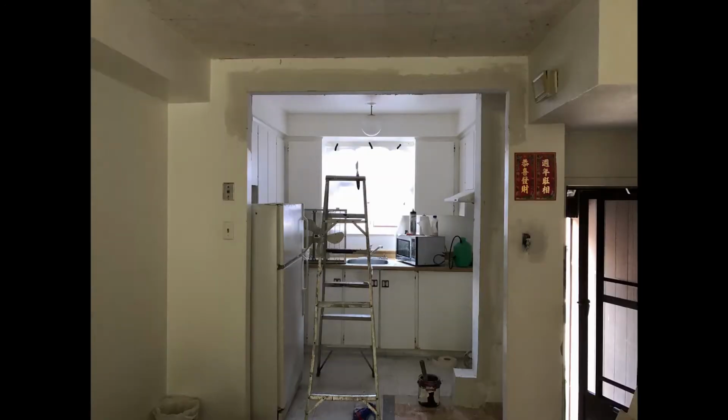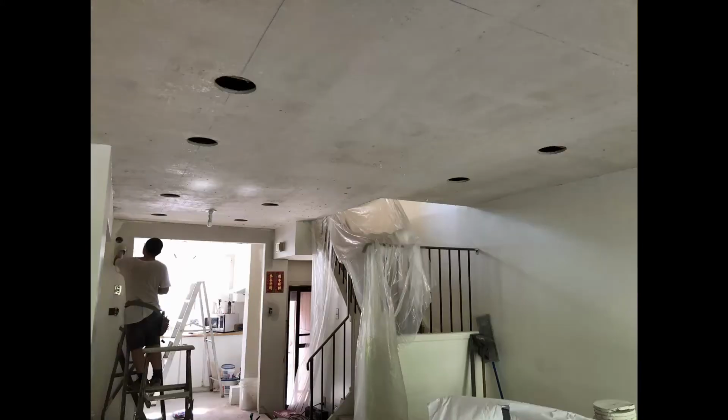Moving on to day 4, I finally started to bring my GoPro to get some time lapses. We also made some holes for recessed lighting. Modern designers will say to use 4-inch lights to make your space look bigger, or even these lights called gimbal trim, which allow you to move the positioning of the lights. But we opted for 6-inch lights just to ensure that we had the space lit up well enough. We didn't really want a dark spot in the middle.